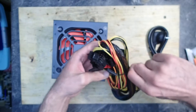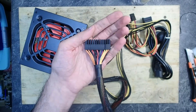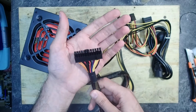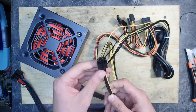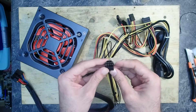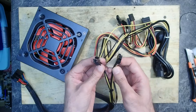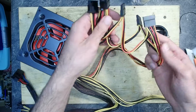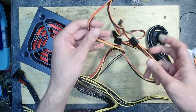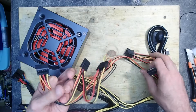Let's see which connectors the PSU provides. First of all, there is the usual 24-pin ATX mainboard power plug — the cable has a sleeve, which is nice. Next is the 4+4 12V CPU power plug, which is modular and should also fit older boards that need only the 4-pin plug. Then we have two strands where each one has two SATA power connectors and one Molex.